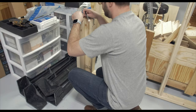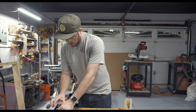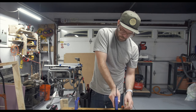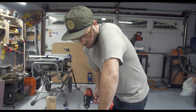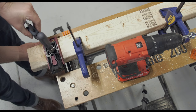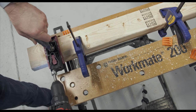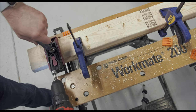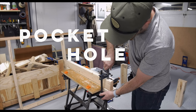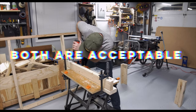I'm drawing arrows in the direction I need to drill my pocket holes because I'm new to pocket holes and I don't want to screw it up. I'm using this mobile workbench to hold my pieces and clamp them down so I can drill the pocket holes and then screw in the pocket screws.